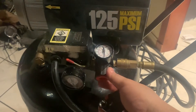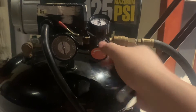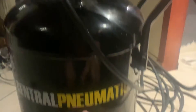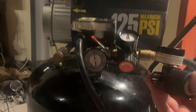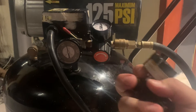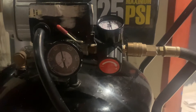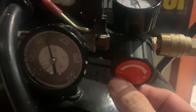If you thread it the wrong way and go lefty loosey, all you're going to hear is air draining — it's going to drain PSI here and drain PSI out of the air tank. Once it is in the proper orientation with the spring side right here, that should fix your problem. Going counterclockwise — lefty loosey — will bring down the PSI and regulate it.